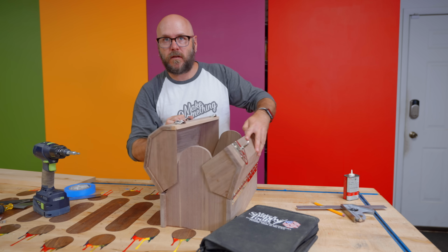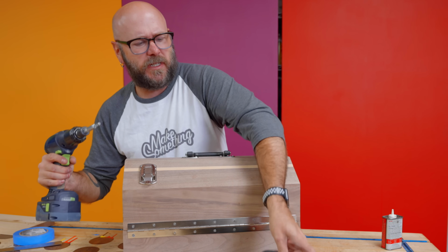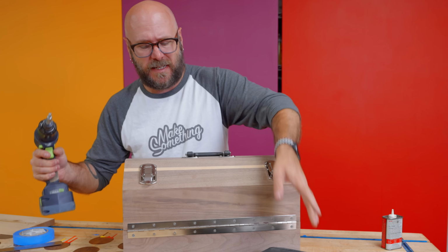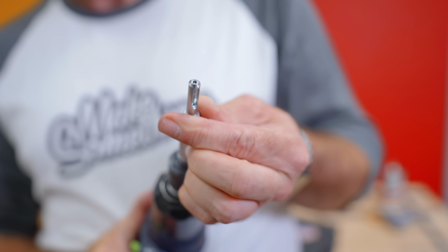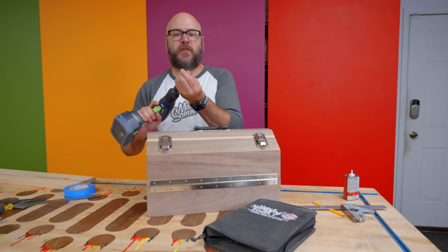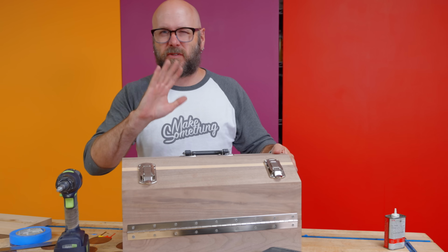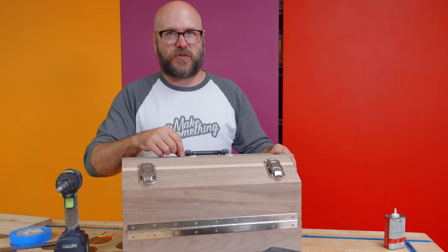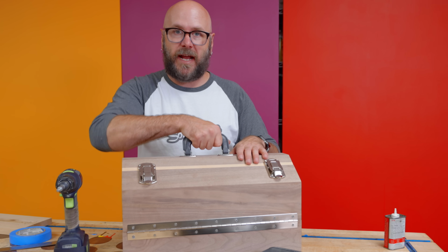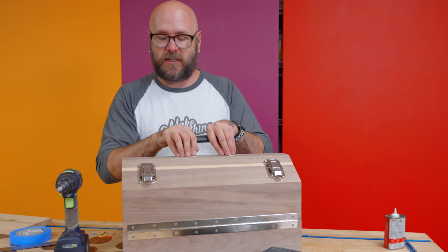One of the things that made this process a lot easier is getting a self-centering drill bit. This one is from Make It Snappy Tools. Again, this is not sponsored. That's just where it came from. So you're using the hinge and the latches as the guide, and the self-centering drill bit drills a perfectly centered hole in there. One of the things I'm slightly worried about is this wood is only a 1/2 inch thick, so that's not a lot of screw depth in there for the handle. So I might also epoxy that on just for some added strength.